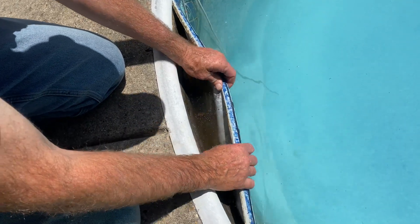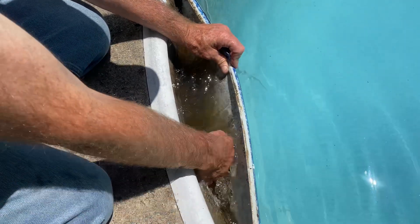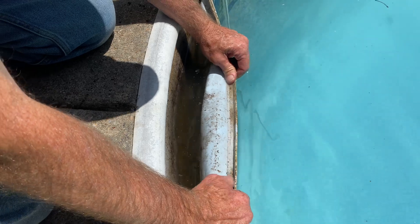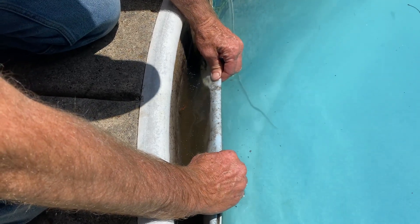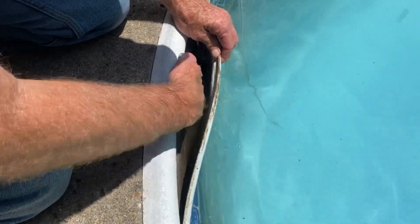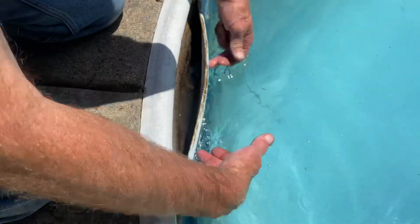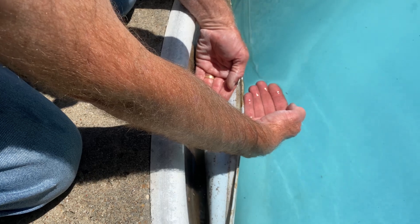I just took this liner out of track to show you what I mean. This is all groundwater, and it's basically the same level as the pool water — right there we are. When the water level in the pool is low, or lower than the groundwater, the groundwater is actually going to lift the liner up on the backside so that it's the same level as the water in the pool.